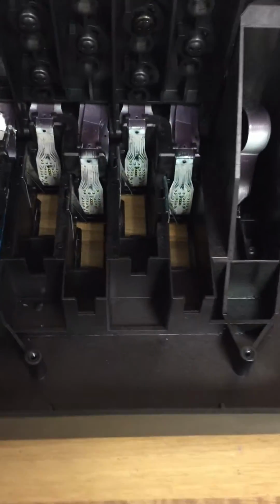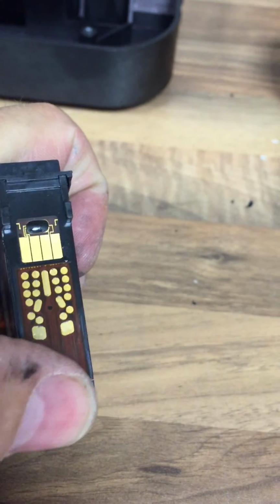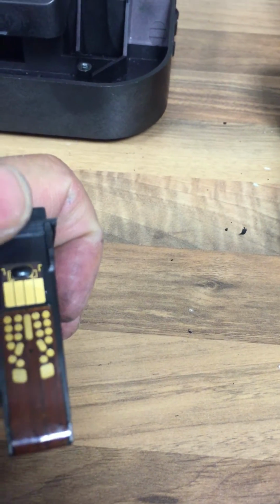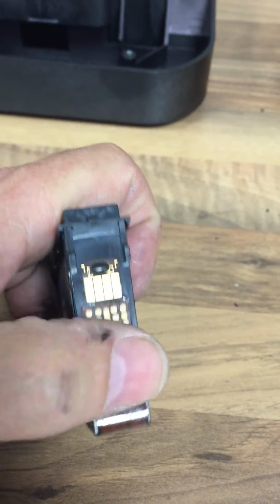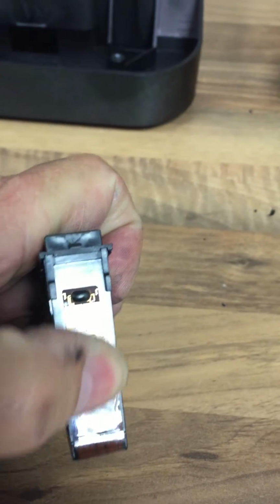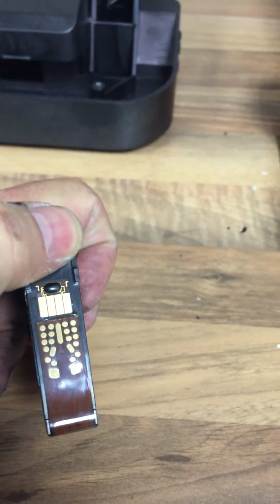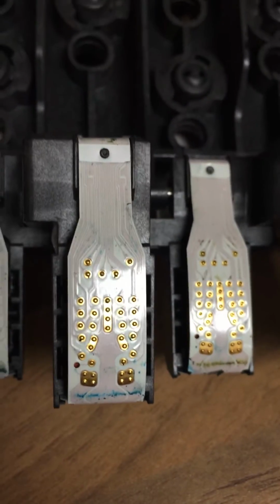And on the actual printhead itself, just pull this out. When you pull a printhead out, normally there's a bit of black ink down the bottom just there. Clean that off, and clean the copper connections and around the copper connections. What you have is something like connection grease. With a clean finger, just manipulate it to get the grease back into the brass parts, so when you push it in, they make good connection with those connections there.